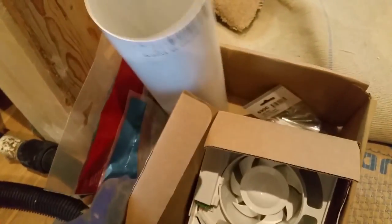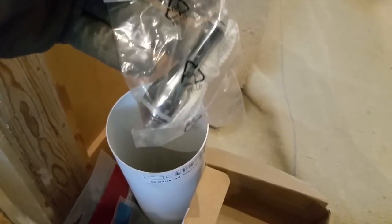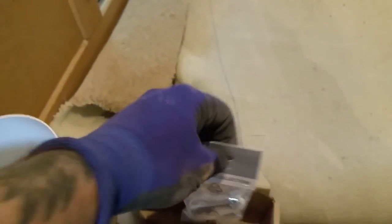He's got a pull cord - personally I'd have just gone for a light switch in the cupboard, but he wanted the pull cord so he got a pull cord with a little chrome fitting. I'm never quite sure what height to do that at - once you've cut the string it's a bit too late to go back, so I'll just put the string in and let him cut it and fit the chrome bit on. I'm going to push the fan housing out flush, go around the other side, mark with permanent marker where it protrudes, and cut it with a wood saw.